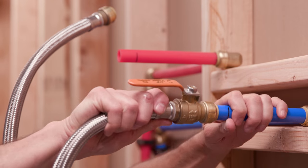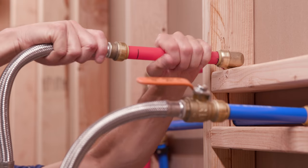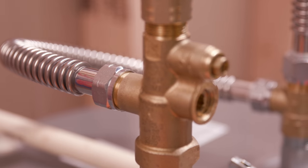Be sure not to over tighten. Push the fitting to the insertion mark you just made on the pipe. Repeat on the hot water outlet side. Now, turn on your water and check the connections. If you notice water dripping from the pipe nipple connection, use a wrench to further tighten. Using SharkBite is fast, efficient, and reliable.